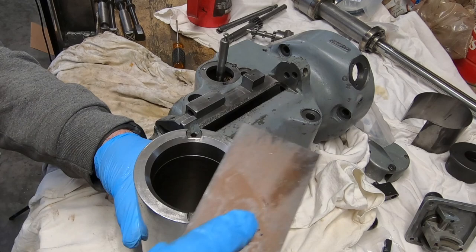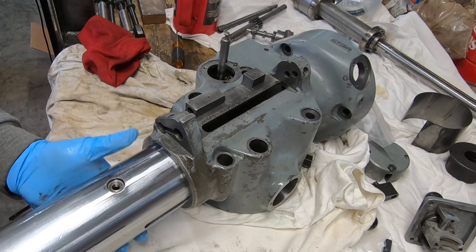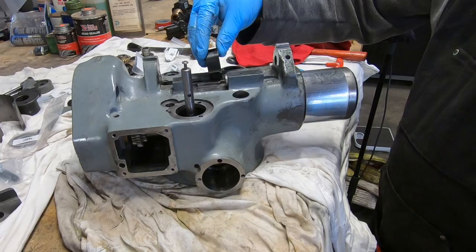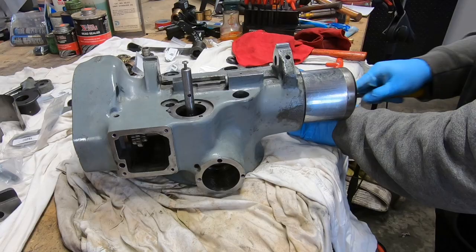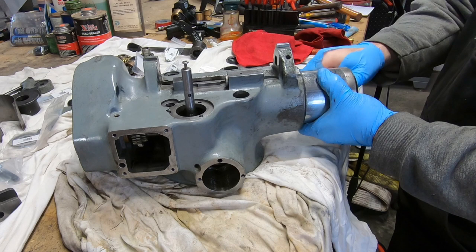So I'm just going to take a file and a stone and see if I can't detect anything and at least smooth it out. It's still getting jammed up almost immediately after inserting it into the housing. I managed to actually get it into the housing but it still feels kind of stiff — I'm thinking that might just be because I'm holding this thing horizontally. The original quill stop knob was missing so this replacement is too wide to fit into the slot in the front of the housing, so I'm taking a file and filing down the sides of it.